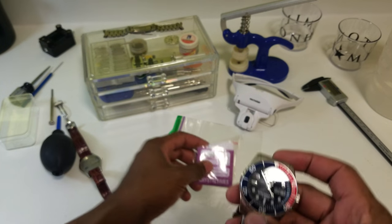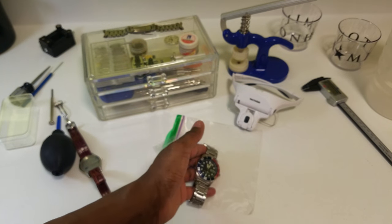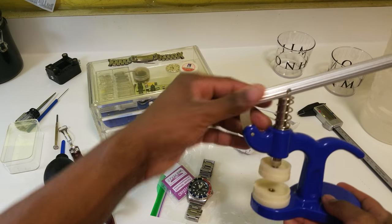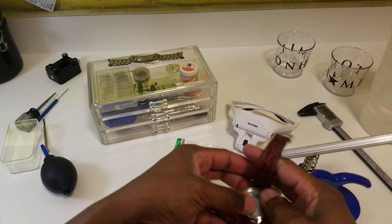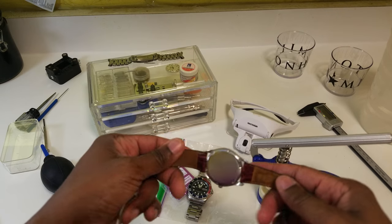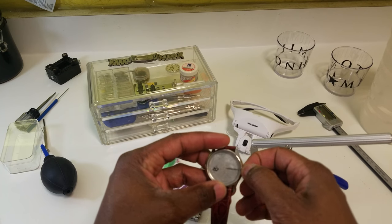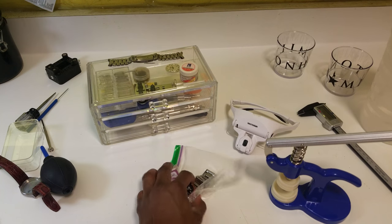What I want to do is modify a sapphire crystal with a blue AR coating onto this watch. To do that, I went on eBay and bought a watch press for the crystal. I highly recommend if you're going to buy your kits, get an old watch to practice on — I had an old quartz watch I practiced pressing and removing the crystal, as well as stem removal. I got the watch press with all the dies.